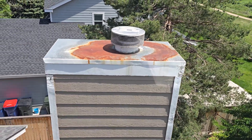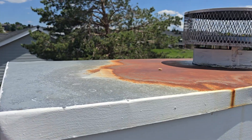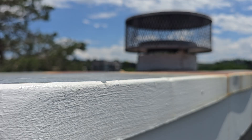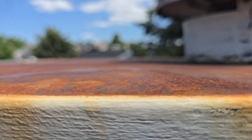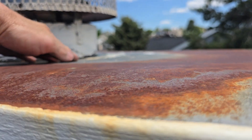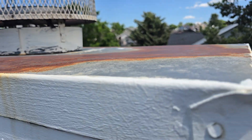As we approach the chimney, we notice the obvious signs of rust up here. We're going to come back to that in just a minute. First, we get down low and we look along this edge and we ask ourselves, is there any pooling? Is it puddling up there? I got a little mounding. I can push in the middle and see if it goes down — it's fairly strong, but I do have some pooling possible right here towards the chimney pipe itself. We'll come back to that.